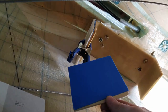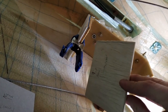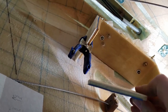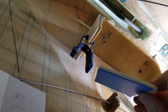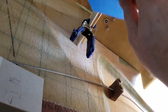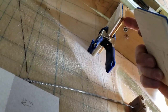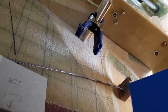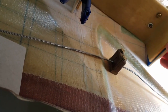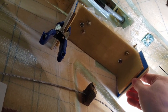All right, well, I've got the braces cut out of plywood. As you can see here, I've used those templates from the cardboard and the masking tape, transferred that over, and then sanded that down to the line. The blue tape is to give me the clearance I need for bidirectional cloth laid up after I put the initial external layup out here, and then I'll remove this and do layups on the inside. This blue tape here is to give me that relief, so after that's bonded in place, I'll have enough clearance to mount this bracket in place.